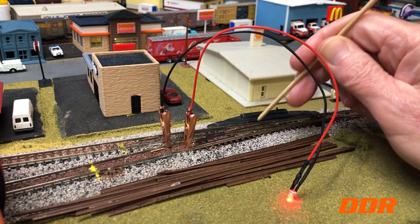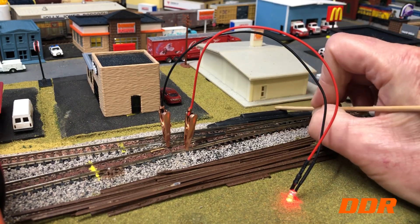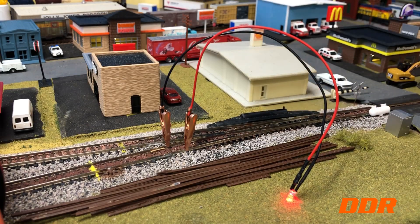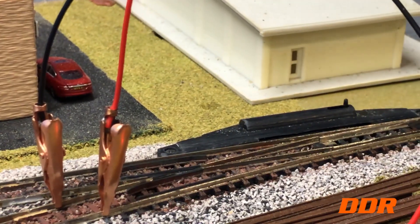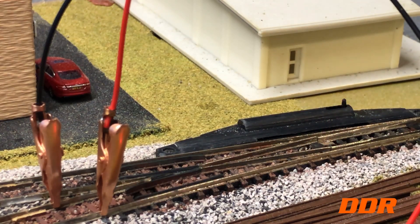That's what's going on — the train drives up on there, hits that rail, and the weight of it breaks contact. Definitely the switch mechanics right here, down in there. It's right there on the pivots — pivot there, pivot there. Okay, we're going to get a toothbrush out and scrub it, soak it and scrub it, see if we can make it happen.